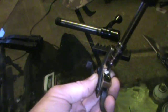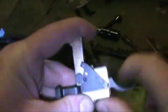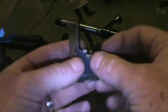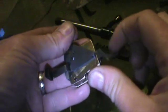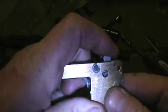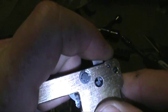We're gonna thread that in - you can thread it all the way in. The tighter you screw it in the more tension you're gonna have on this trigger. That trigger is good and tight right now and we don't want that. First thing we're going to do is back that tension off just a little bit. I went about a half a round. Now it's a lot lighter just from doing that - the trigger is a whole lot lighter. Now we're going to control the creep.